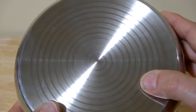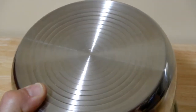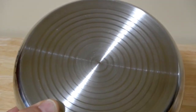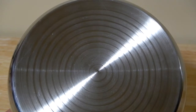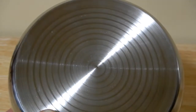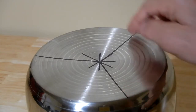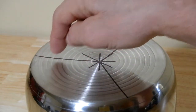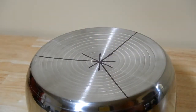What I need to do now is take this three quart pot and make three feet on the bottom by drilling holes 120 degrees apart, so that I have standoffs to mimic the original basket. Then I've got to drill a multitude of holes in the bottom for airflow — those arcs were stamped out in the original, so here I'm just going to drill holes. The next step was to lay this out for the three feet: 360 degrees in a circle divided by three is 120 degrees, so you see there'll be one, two, three evenly spaced points.